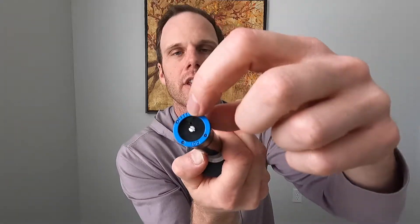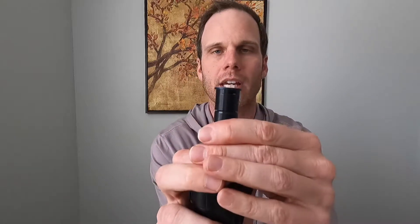The little dash marks show you where it's going to be spraying — the 90 degrees it'll spray out. The Q stands for quarter, so 90 degrees, and here's the port where the water comes out. Grab the neck and just rotate it — it's okay to hear that clicking. Rotate it so your edges are lined up. You can roughly do it before the water comes on, then fine-tune it after, lining it up with the edge of your concrete or fence to make sure it's getting the coverage you need.